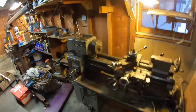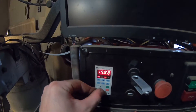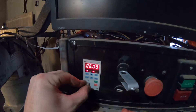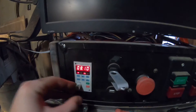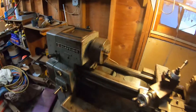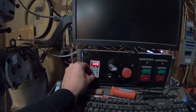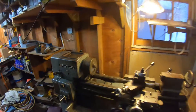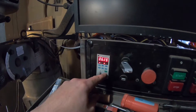I nailed it on the first attempt — she's a runner. I have the belt on the maximum speed setting so I can back the frequency way down on the VFD. All the way down to like 8 Hertz it's going slow, crank it up to about 30 percent and now she's moving. That's really all there is to it.